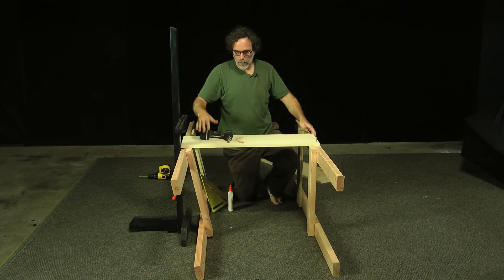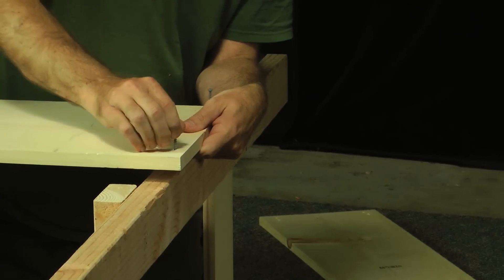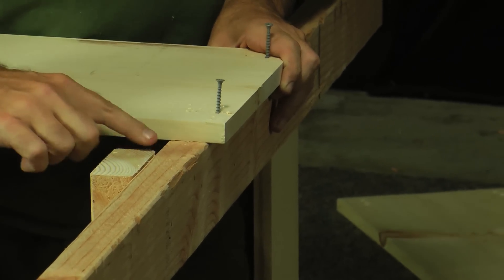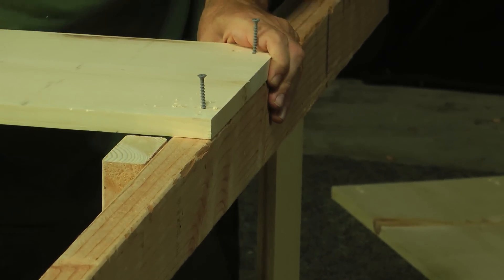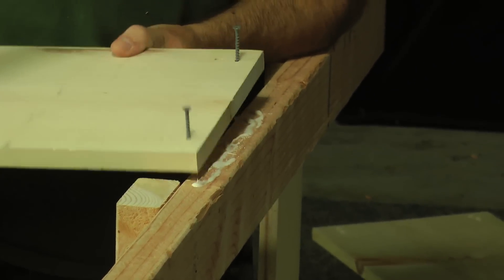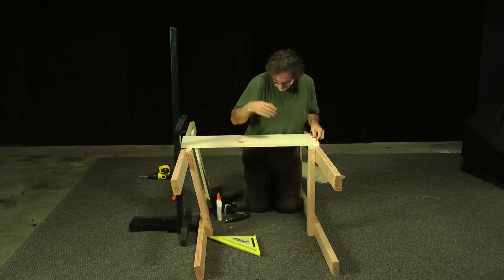Now that I've finished the two H's, this one is just being held up to support the wood on this side. I'm going to screw and glue it to this one first. Remember to make sure the holes you drill let the screw slide through — that's really important so you get a good glue clamp. Notice that I'm putting this board below this two by four. Don't try to put it on top because if this is higher at all it's going to make it wobbly and you won't get good glue contact. Put some glue on and glue down this first one. Check it with a right angle, then screw it in.